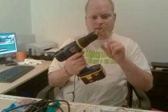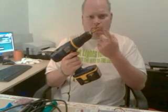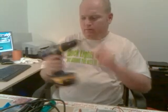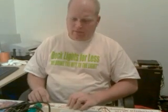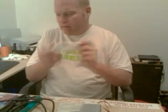Tools you're going to need: a drill. I use step bits because I don't have to keep changing the drill bits out — one size works for all. If you go to Harbor Freight they sell the kit, it's not too expensive. Step bits are the way to go. You're also going to need a pair of wire strippers — use whatever you have, a knife or scissors. And you're going to need some silicone. Make sure it's a good type that can handle all weather. I use 3M marine silicone.